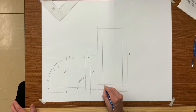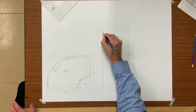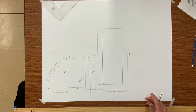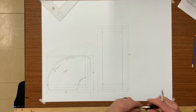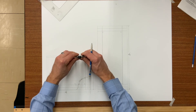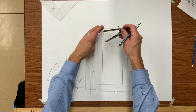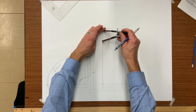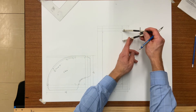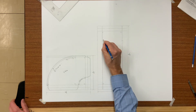Now that you have your Pittsburgh locks and S&Drive connectors scribed, go ahead and mark your corners. Use your compass set from E to G on the cheek pattern and transfer that measurement to your heel. This will indicate that from E to G there is no roll.